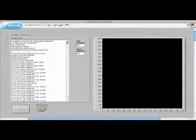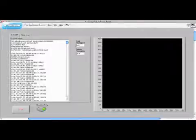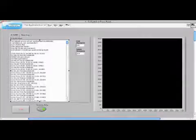What I've been able to do is create a LabVIEW program that uses the Arduino toolkit to control an Etch-a-Sketch. There are two primary ways to control it: the first is by using G-code, the language traditionally used to control CNC machines, and the second is using a sketching mode within LabVIEW — where you sketch an image and have it output on the Etch-a-Sketch itself. I have a simulate-only mode here so we can preview what we're going to get.